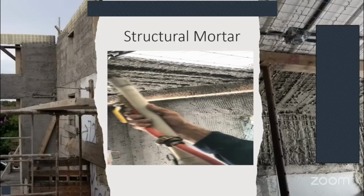Yeah. So when you screed it, then you just make the lines on it and leave it there, and then you can finish it with either 1/4 inch or 3/8 of an inch of type N mortar. The type N is 750 pounds. You're going with that softer mortar because it doesn't crack as much? That's the idea.